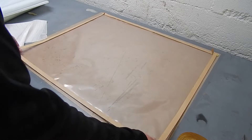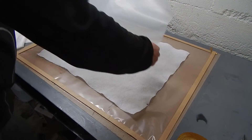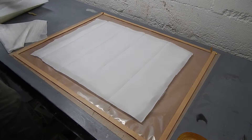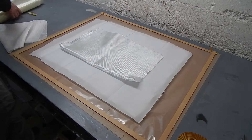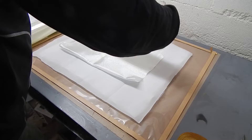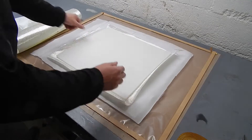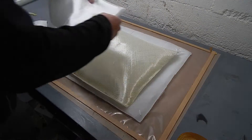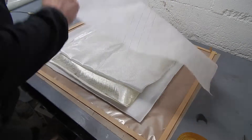Here's something I like to do during a wet layup — just to make sure I've got everything sorted before I go mixing the resin. Putting the bag down and then stacking everything in reverse. It's a little fussy but it makes a big difference if you're doing something bigger or more complicated where you need to be prepared. If you need to stop in the middle and go cut something, it could waste a lot of your open time and throw you off, because time tends to slow down and mess with you when you're doing wet resin work. So set that aside and everything will be ready for you right in the order you need it.